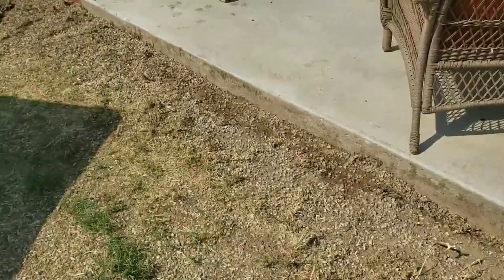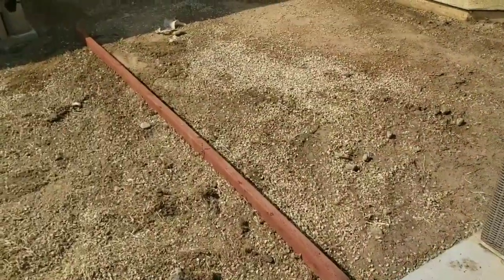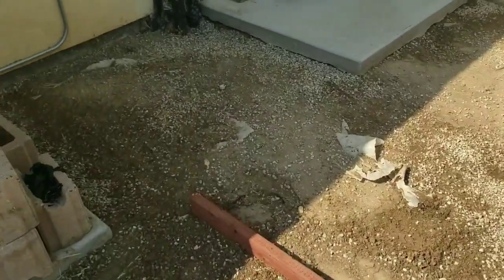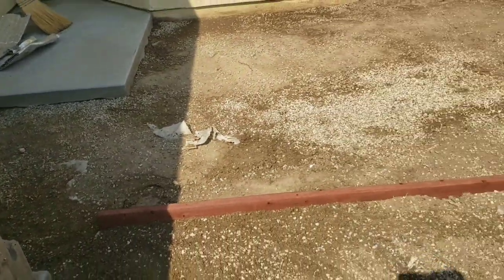We are already progressing. You can tell we're going to put the steps there, or the bricks. He had the bricks as extra there, and it took me a little while to figure out what I was going to do with the pre-treated wood on the left side in this little area. I just turned the treated wood around and I gave it a difference of about a quarter inch. The left side was higher than the right side, and that's what it takes.